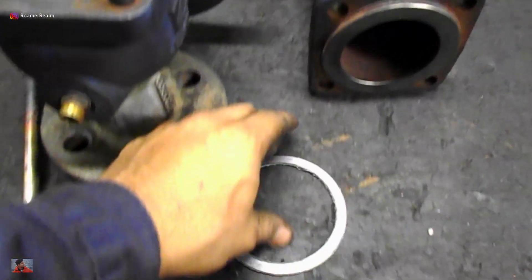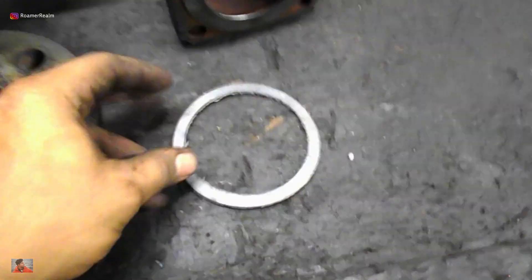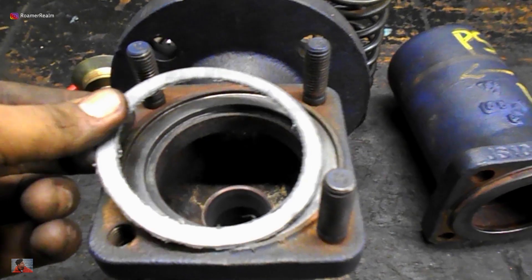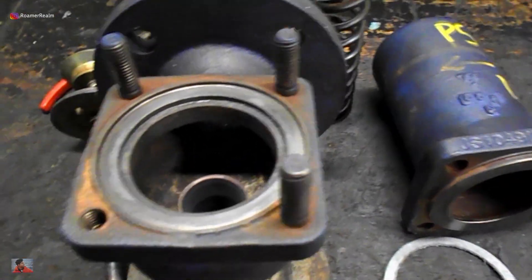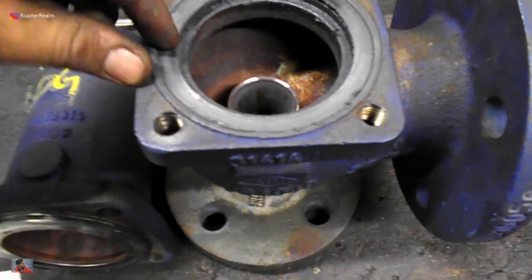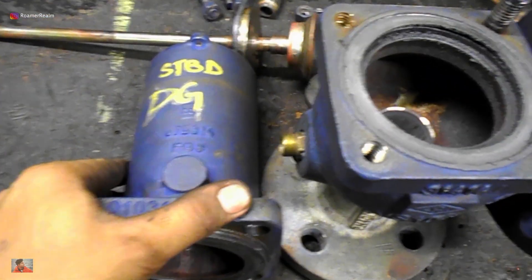Only special graphite gaskets with a wire mesh inside are to be used in high pressure steam systems. It's slightly blurry in the camera, but you can see the wire bristles protruding out from the gasket — it's hard to miss in real life. For the fitting of the gasket in place, it is important to record correct measurements and fabricate a gasket of the right size — neither too small nor too big, as in both cases it won't really do any good.